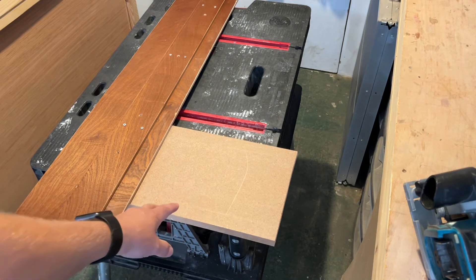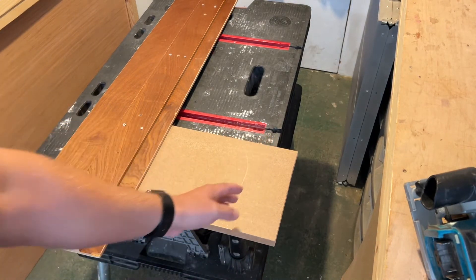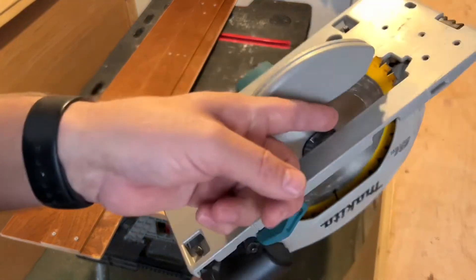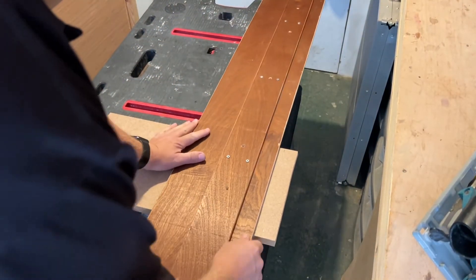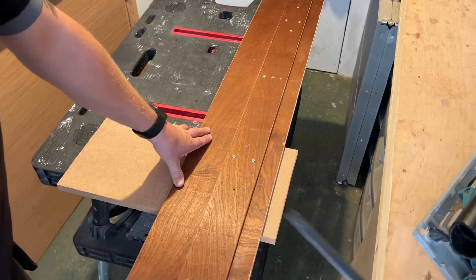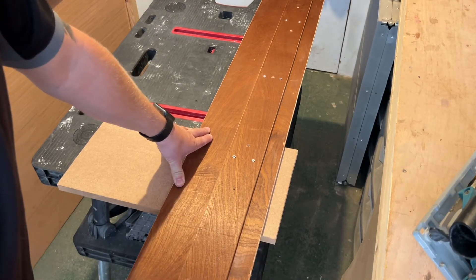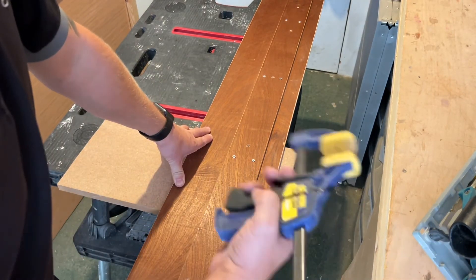This is more all about the worktops. So let's say this is your worktop upside down and this is the edge we want to protect - we've got to cut into that edge. So basically, wherever your mark is, mark it there and there, we'll cut in this way. So we've got the smaller part of the guard on this side. Just put that onto your line. If you have got overhang you can just use these clamps. If it's a worktop and you're working from underneath, I have got some holes in here so you could just screw this down. Sometimes you don't have enough room to put your clamps.